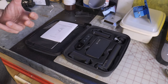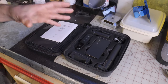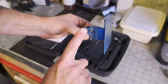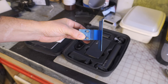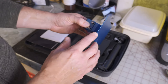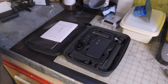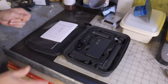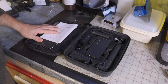The new software is better, and using those targeting dots — those little round things you saw on the scan — helped immensely. A lot of it is learning how to move around your scan. Going around corners was the thing I had the most difficulty with: you're scanning along and then you hit a sharp edge and tracking is just completely lost. What information does appear is a jumble. I solved it somewhat by going real slow, backing up and going forward repeatedly. With the new software that I downloaded it's a lot better.